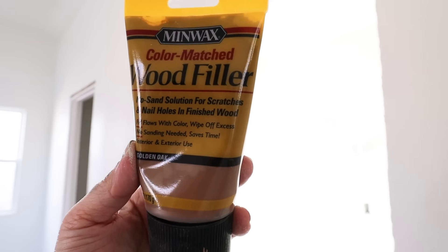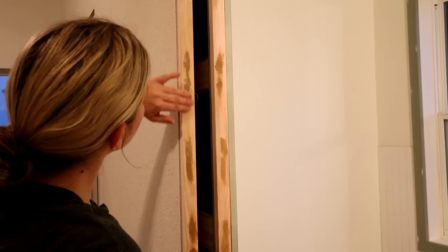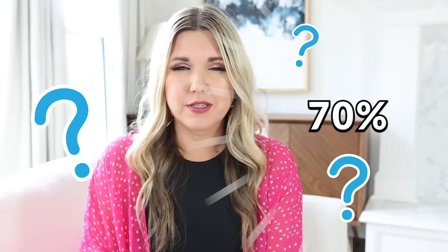I also had to add some wood filler to the side of my pocket doors. I painted the entire room — ceiling and walls — with Swiss Coffee at 70%, which is the color I've been using throughout the entire house. I've been getting comments asking why I get my paint at 70%. The reason is that Swiss Coffee at 100% is a little yellow, and at 70% it becomes more of a neutral color. You can always change the opacity of paints to adjust the color, and I find I do that more with white colors than with blues or greens.